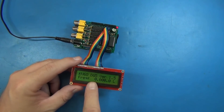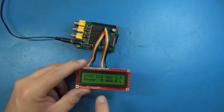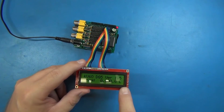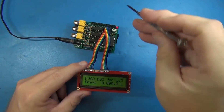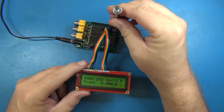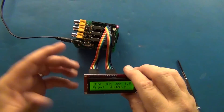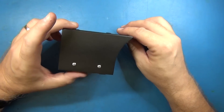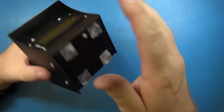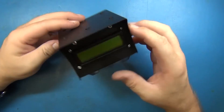The display shows KV60 - that's Steve Lender's call sign and his webpage. He calls it the DG5 emulator version 1.5. The 'L' stands for lower - it will tell you lower sideband, upper sideband, or CW when calculating. There's a contrast adjust on the board so you can tune it just right. With the lab lights off, the backlight is comfortable to the eye, not too bright - just right. Time to build a box. The box is done: painted black, opening for connectors in the back, feet on it, display mounted nicely with a little overhang just for looks.